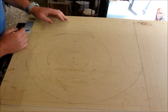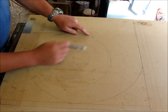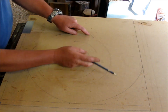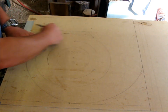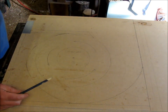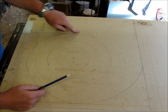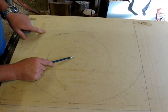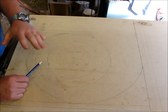Now, this right here is going to be my stripping edge. As the impeller rotates and the air gets slung out and comes through this, what's actually called a volute, as the air gets slung out here, it hits this stripping edge and it gets stripped off the impeller, and that's what creates your pressure over here and the outward thrust. So anyway, this is going to be the stripping edge, and this is going to be my positive pressure side. This is my negative pressure side. Alright, all of this will be built up to the height of my impeller plus a 1/2 inch.